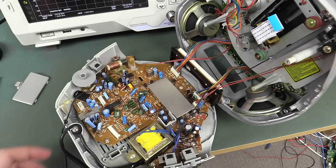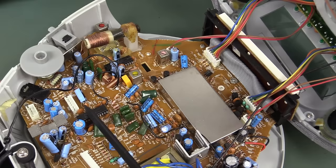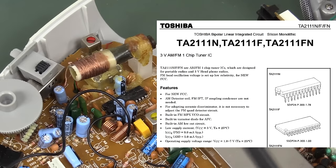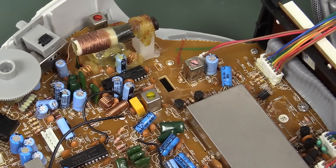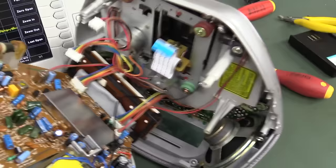You know I couldn't resist - two-minute teardown. Typical construction that you'd find in something like this: single-sided PCB of course. They've got a Toshiba tuner in there and actually that'd be a Toshiba amp. There's all the wax I was talking about for the coils. There's our AM receiver ferrite rod - it's just hanging off the end there, a bit loosey-goosey. The trouble's going to be in there somewhere. It's basically bugger all in the rest of it - got a regular transformer in there to power the thing.